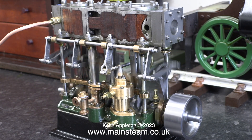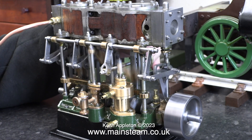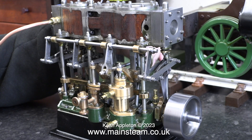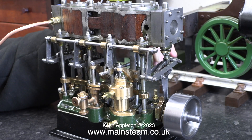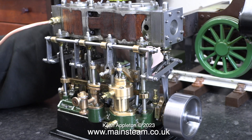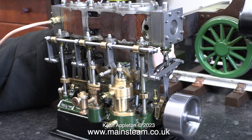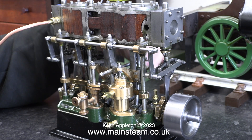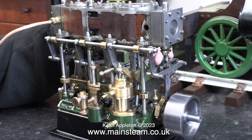In the next episode I will show the final adjustment of the valve gear, hopefully to make the engine run much better than it is doing currently. This job has been more difficult than I thought. My conclusion is that a Stuart triple expansion engine is difficult to build, difficult to assemble, and if you follow the drawing to the letter, difficult to time. I much prefer individual eccentrics.